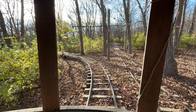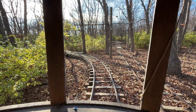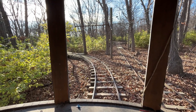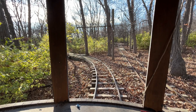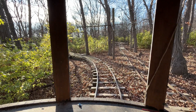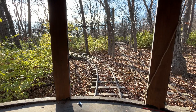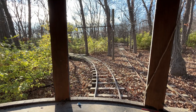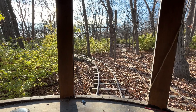So now we're going to go down this hill. This hill is about a 4% grade. The DC-powered cars will pretty much roll uncontrollably down the hill — you have to ride the brakes all the way down to keep them from running away. But this, because this AC motor has dynamic braking capability, it will hold the speed to whatever throttle notch I have set, as long as there's power. So let's demonstrate that.